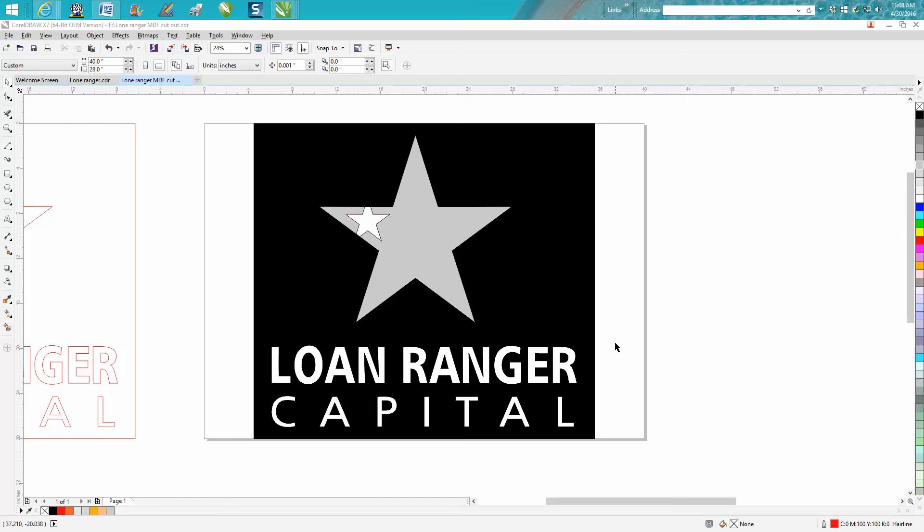This is a CorelDraw video mainly for a plasma cutter. I also have a plasma cutter and a laser, so I'm going to incorporate both. Everything that's black is going to be cut out of 3/8 or 3/16 inch metal. The black will be rusted metal, and the star is going to be offset from the rusted metal 3/4 of an inch. It's going to be sandblasted gray, and the white letters and white star will be welded — I'm going to drill a hole in the back of the star and weld it to the top.